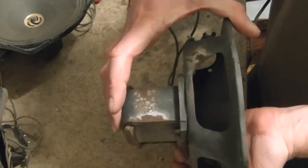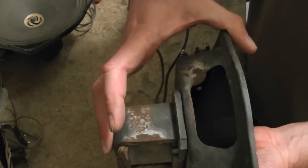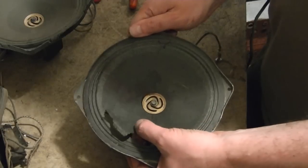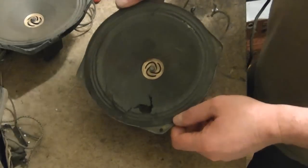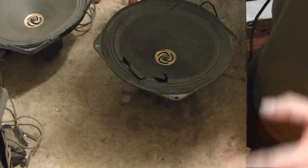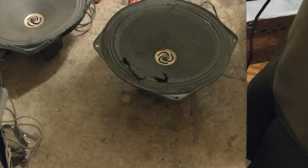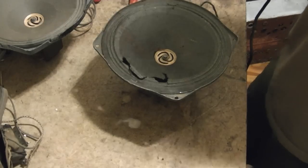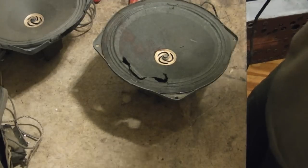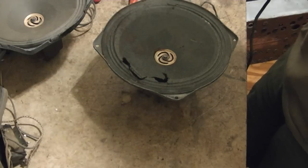I can tell there's a frame that got a bit rusty down in the smaller original speaker - that's probably causing the rubbing. It obviously has some tears but I can try gluing those up. So I think what I'm going to do is clean and glue these up as best I can, fire them up, see how they sound, and whichever pair sounds better I'll put back in the radio and have the other two sent out to see what someone can do with them.